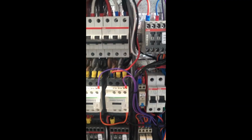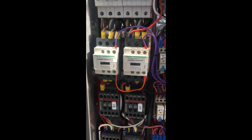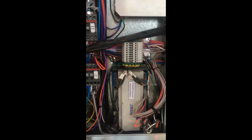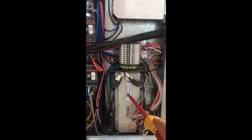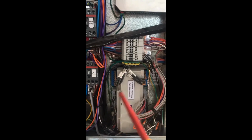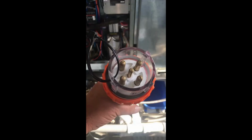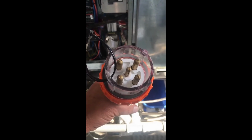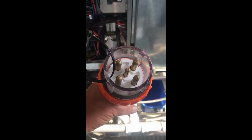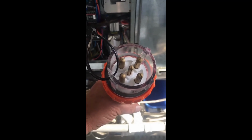Also check for any rodent or cockroach damage in the electrical board. Any damage must be reported immediately. Pay particular attention around the I/O board and all these plugs and fittings to make sure there has been no cockroach damage in there. Inspect both plug and wall socket for burnt terminations. Should either of these be black and carboned, they will need to be replaced.